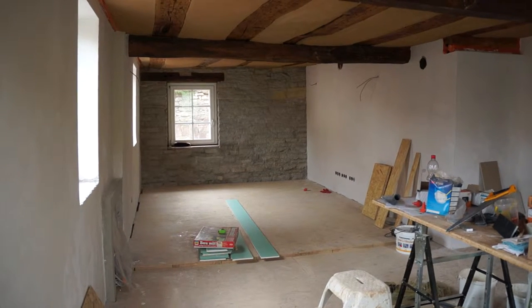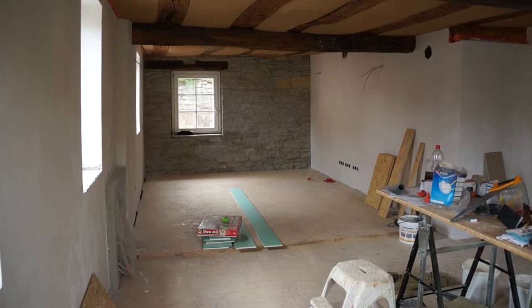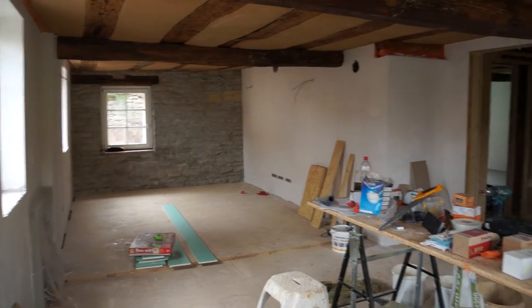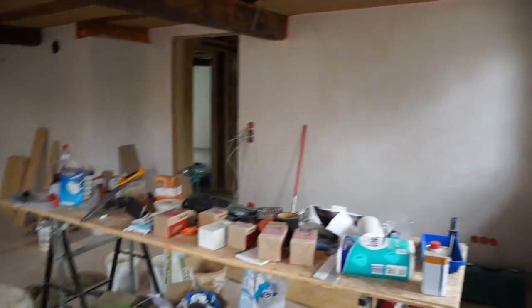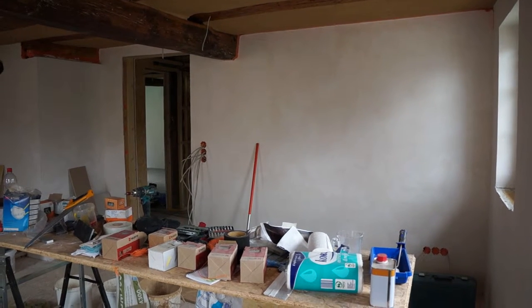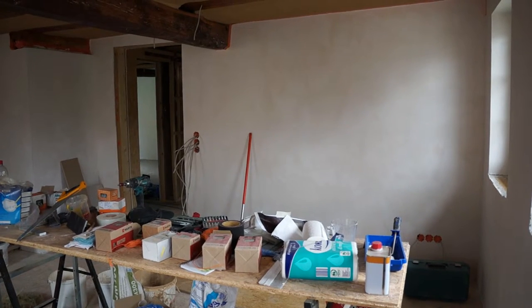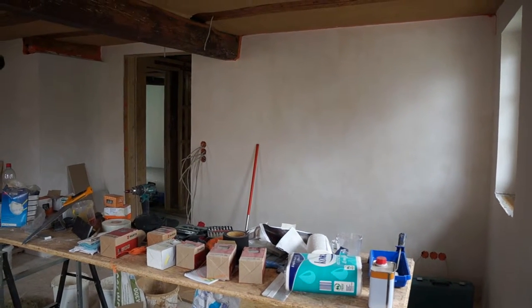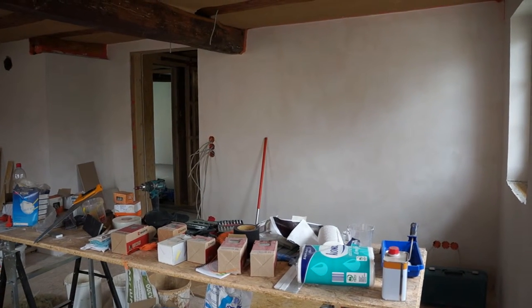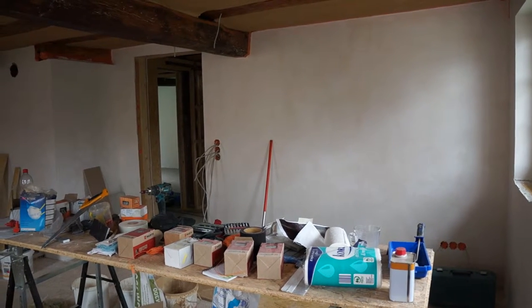It's been quite busy for the past couple of weeks, but I'm struggling to think what can be shown, so a lot of stuff is not really that obvious. In the living room, pretty much as before, except I've done a full skim coat over the plasterboard that was on this wall here. Some people think it's not needed, some people say it gives a better finish. I think if we're going to paint directly onto the walls and leave them smooth, a skim coat makes sense so that we don't see the jointing or the screw holes where they've been filled.